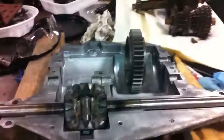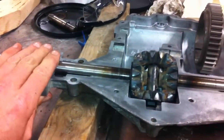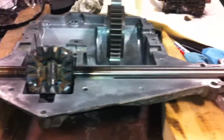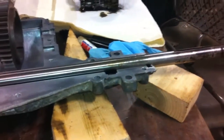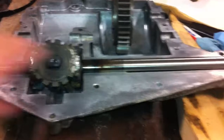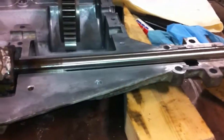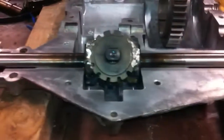It was kind of weird — I welded it together and I thought I warped it, but I think it's an optical illusion. What I did is I put it in both cases, made sure I could hold down on one axle and try to rock the other end, see if I felt anything. I turned it 90 degrees and did the same thing, put it in the other case, and it didn't wobble or do anything, so I figured it must be cool.